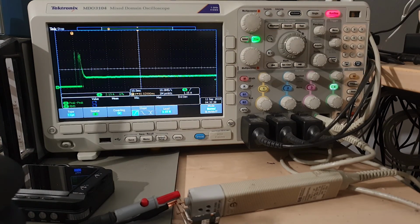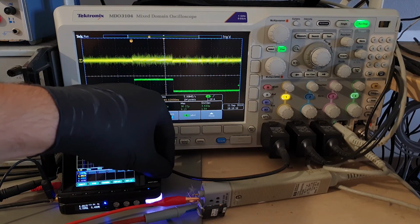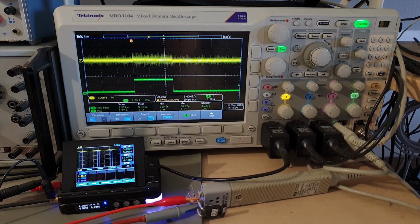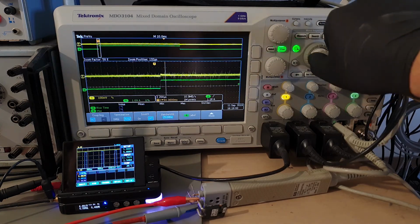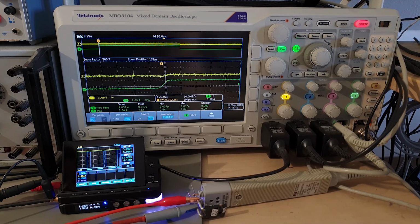Both of my linear power supplies are guilty of that, and with those it looks like this. Here's the perfectly beautiful response to repeated 3 ampere pulses in the middle of 100 milliampere idle. No complaints whatsoever. Now that's finally all I can think of testing. Wanna know how they did it?